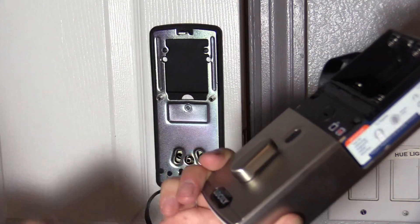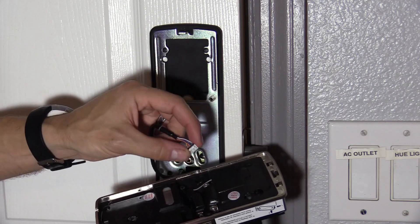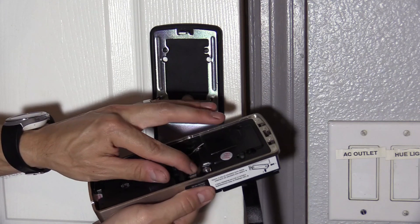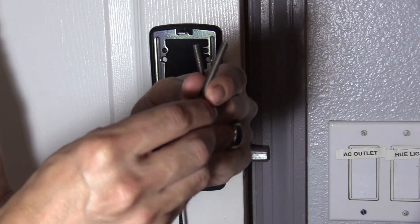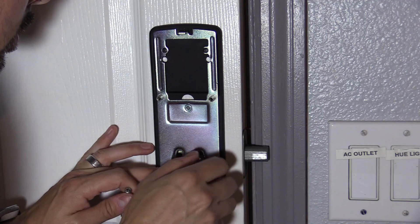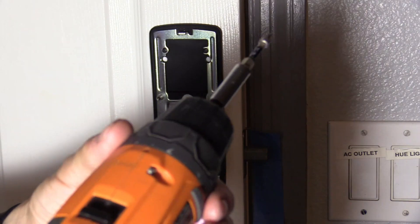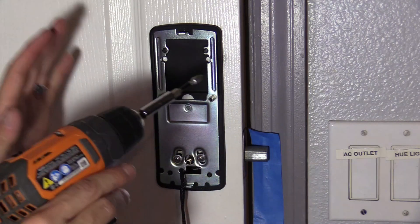Go ahead and insert the cable. Any time you have to remove this lock, do not pull on the wiring — use needle nose pliers and grab both sides of the white connector end, then slightly wiggle it out. Take the long bolts and the washers and put the washers on the long bolts, then hand screw them in first. If you're using this on an inside door like a bedroom door, do not over tighten these screws as they can damage the outside lock. Set the drill on the lowest torque setting, which is one, and make these screws snug.